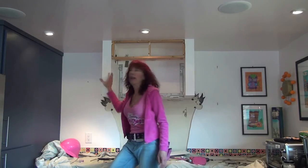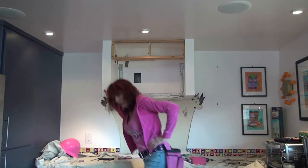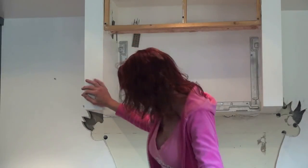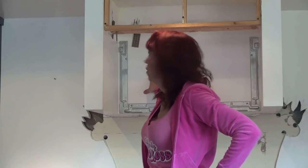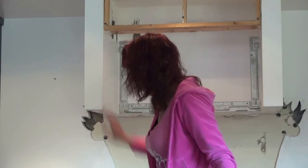This is what we call a happy accident, because this microwave box really extends way too far from the wall. That means when we're at the stove doing our cooking, we bang our head - and that's just kind of annoying. This guy says he's been annoyed by this ever since. So what we're going to do now is cut this box off right here behind here, and then we've got six or seven inches that we can actually shove this box back. That way when we're cooking at the stove, we're not going to be banging our head.